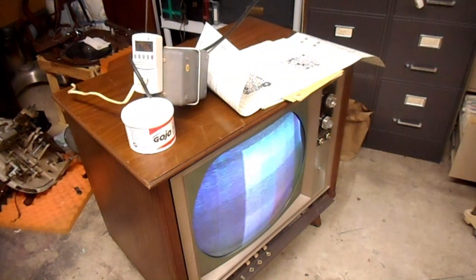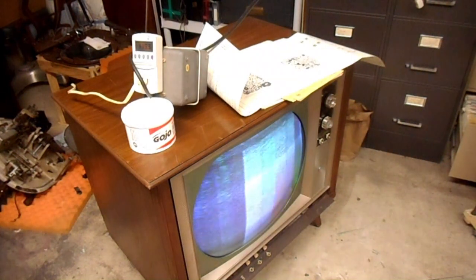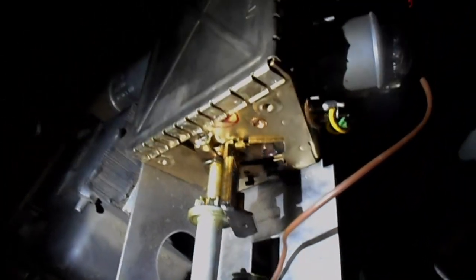Before I do that, I'll pull the tuner. I gotta pull the tuner. Figure out why the fine tuning isn't working. That's gonna annoy me too. So I missed it earlier, but the fine tuning mechanism is completely missing. I'm guessing it was like this when I took it apart for the winter cataract removal video. You can see this gear has absolutely nothing to connect into. There should be something in this spot here, and there's nothing.